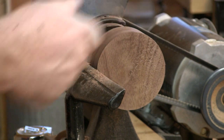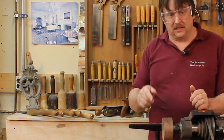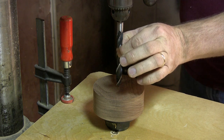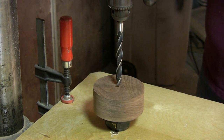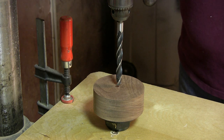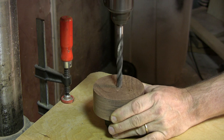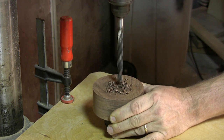And we can take this and head into the drill press and drill the holes for the threads that'll keep the stick on the base. Our next step is to take that blank that we turned and drill. I've got a half inch bit in the drill press and we're gonna drill it down in there about half an inch to pocket this hole. So unfortunately, Tim, this means you're gonna have to turn the drill press as well. So anytime you're ready, Tim. Okay, you can stop.